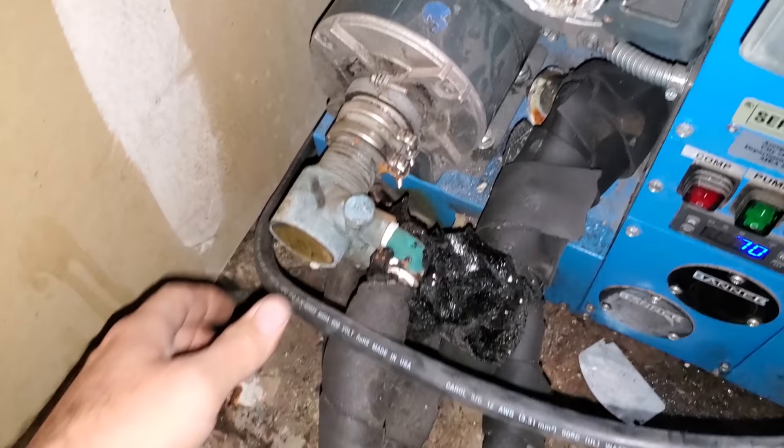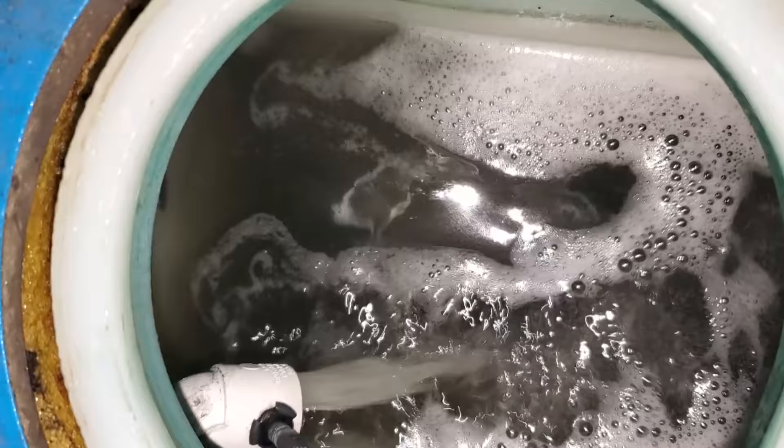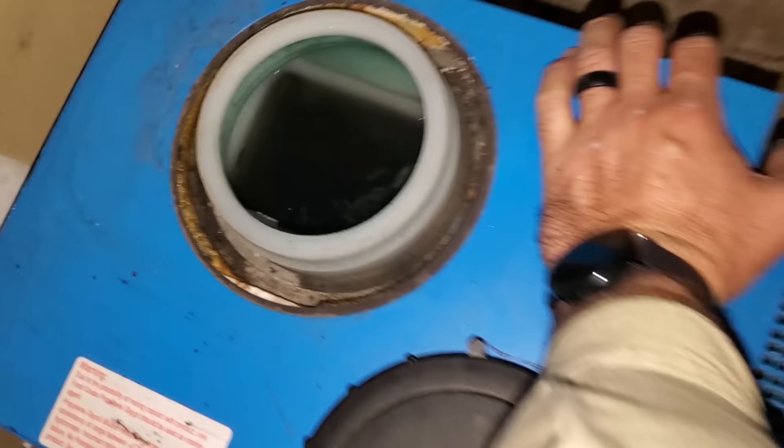After leaving it off for a few minutes, I put this one back together and we're moving glycol now. Makes me wonder if the heat exchanger was frozen. But look at how nasty that is — now that I'm moving it, it's gross in there. I'm going to do a refractometer test because that sure looks really watery. We could have frozen heat exchangers. This is so bizarre.